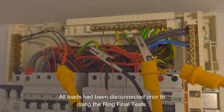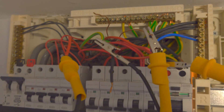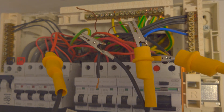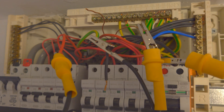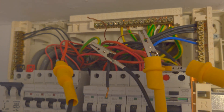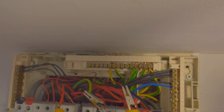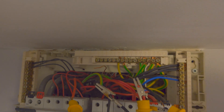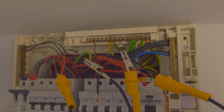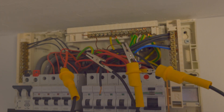Except for the fact that for some odd reason the garage circuit was tied to this circuit - what looks like by mistake. So the earth was joined to the earth of the ring. If there was a fault on the garage circuit, an earth fault, it could be affecting this ring. So the garage earth is this one and the garage neutral is that one, and the line for the neutral I've still got plugged in. My thought is I'm going to take the line out of the garage - it'll be totally isolated - and I'm going to take the neutral out as well so the garage circuit is totally isolated.